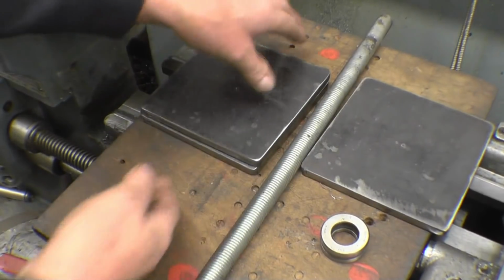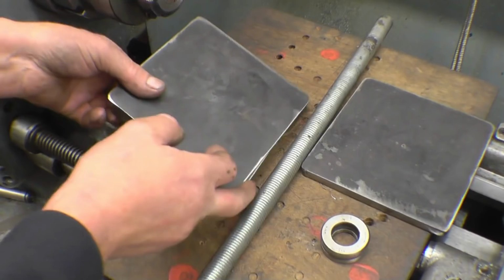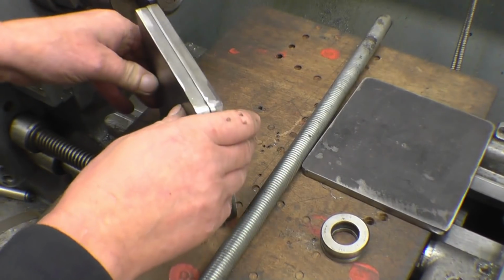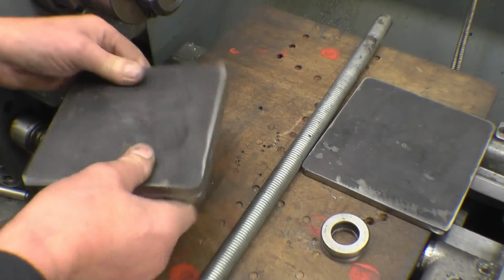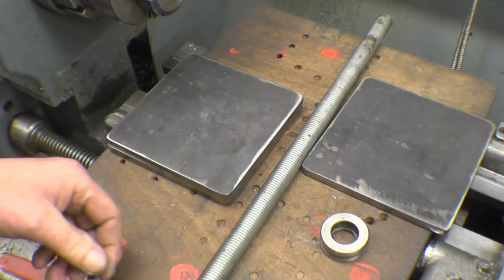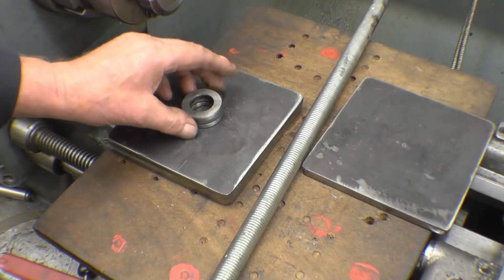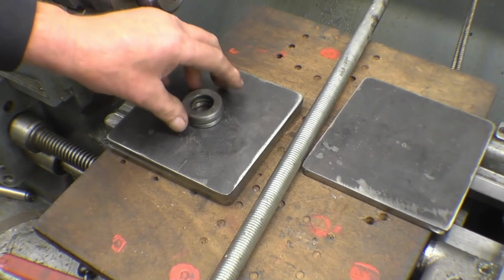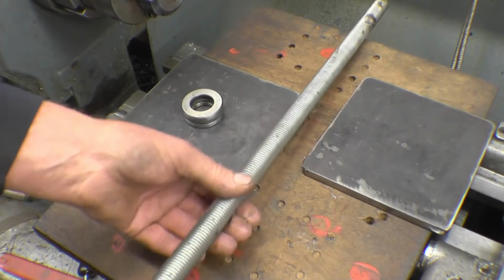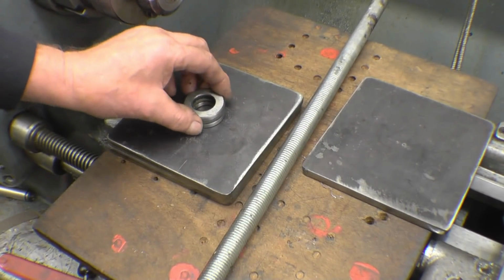These are the plates I've just burnt out for the liner puller. The top plate, you want a 19mm. I've got 10, so I'm just going to tack two 10mm bits together. That has a hole bored through there. That threaded rod goes through it, and the important thing is I'm going to put a thrust bearing on the top. The thrust bearing like that makes a massive difference when you're using something like that to pull with, because you haven't got the friction of the nut on there.